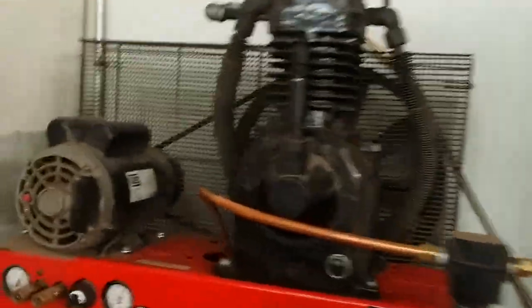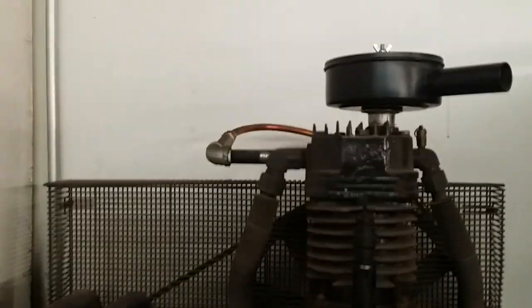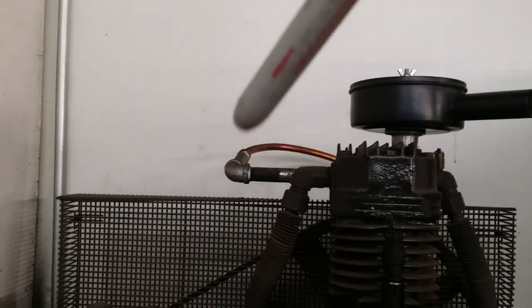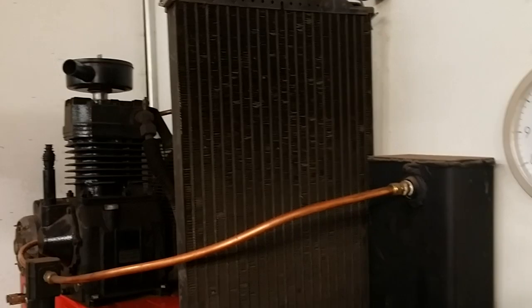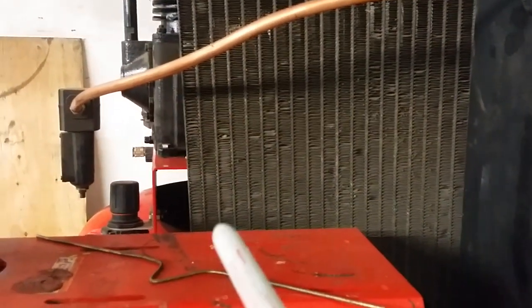Just a quick overview of how I get clean dry air over my Hypertherm Plasma Cutter. I come off the cylinder head of the two-stage compressor with a half-inch pipe nipple and convert that over to half-inch copper flex tubing. That comes over and into an air conditioning condenser coil out of a mid-80s Suburban. Air comes in on the inlet side at about 180 to 190 degrees off that cylinder head.